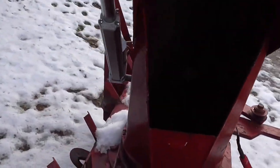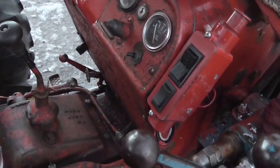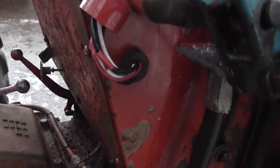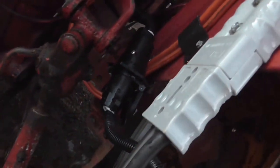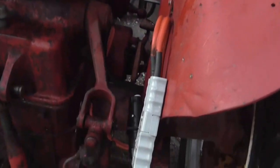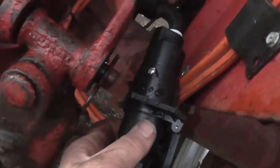The wire goes up to the actuator on the other side. I'm going to finish putting it together — all wired up. I need to put some wire loom around the wires underneath, and a grommet going in the firewall so it doesn't chafe the wires. The wire loom runs all the way back down into the disconnect switch. The battery can be charged on the snowblower from the house battery on the tractor via a quick disconnect, and the switches for the winch and linear actuator are on a 7-pin trailer connector.